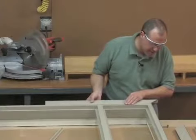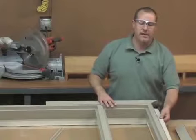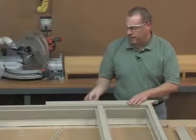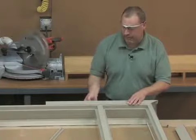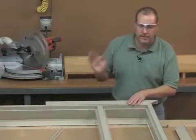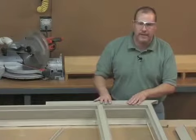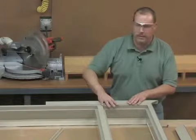The reason these pieces are applied in the field is when this door unit is sent out it's got the nail fin on it. They'll use the nail fin to hang the door. There is no nail fin extending beyond out by the one by four casing. Even if there was a nail fin that far out there would be nothing to nail it to — no studding. So therefore these pieces are usually pre-cut to size for the contractor and then installed in the field after this unit has been put in.